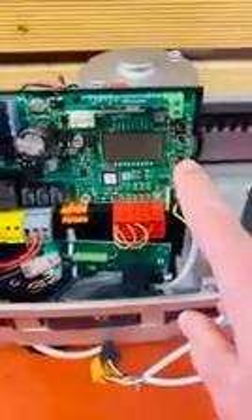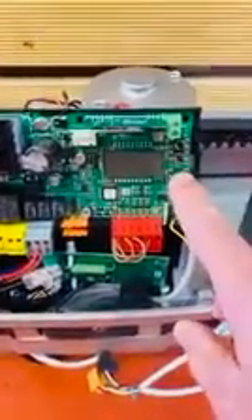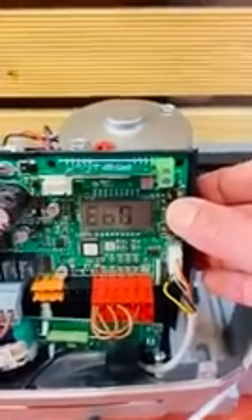The simplified menu will get the motor to calibrate how far it needs to run open and close and so forth. What you do is press the OK button once — that's the third button down; the top two are your plus and minus to scroll through the menus to change your settings. Hit the OK button once and the word 'Language' will come up. It should be factory set to Italian, so scroll down by hitting the middle button until you see the word 'English' come up — there it is — then hit OK.